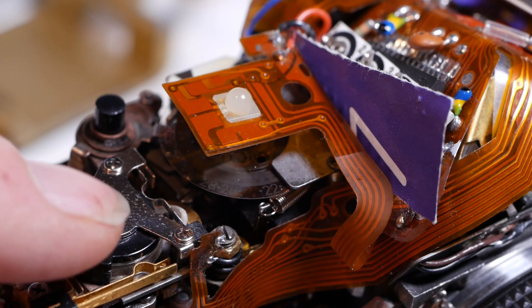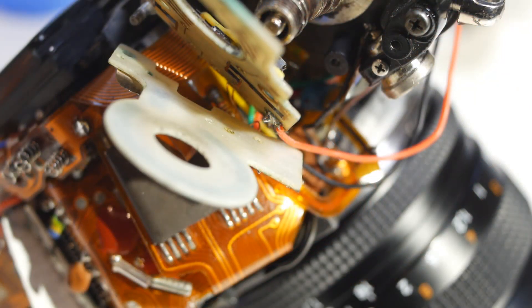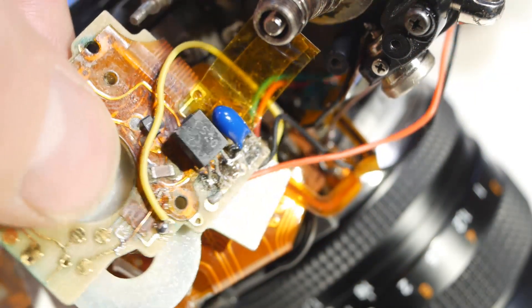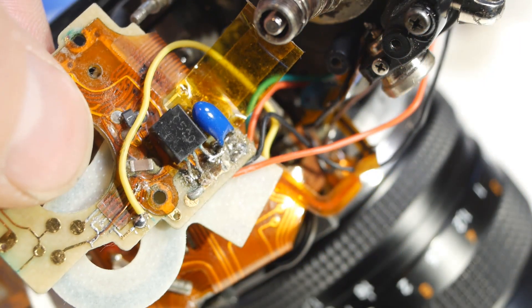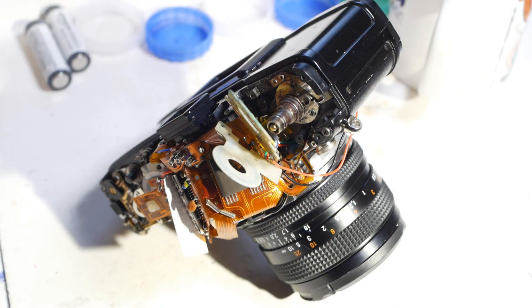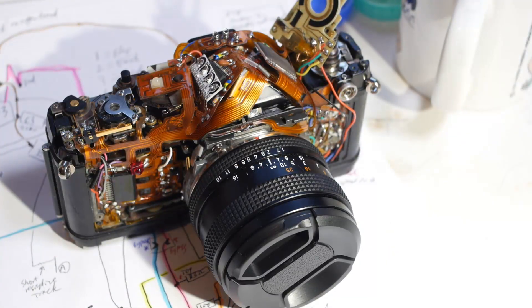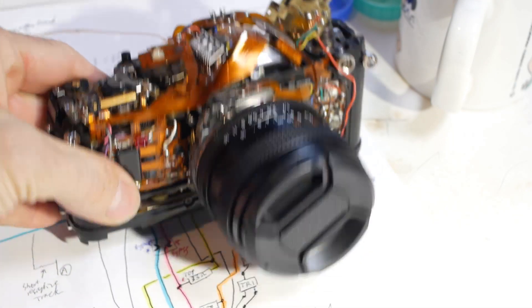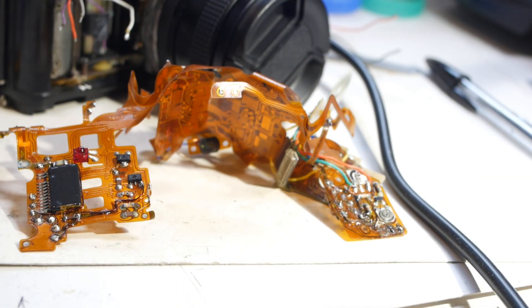Short circuit eradicated, and it's now working on battery power — by which I mean the power LED illuminates, and not much else, but at least I can now start probing the thing properly. After that I set up the oscilloscope again, the first target being the voltage regulator. And once I'd seen how bad the spikes coming out of the regulator were, I immediately powered the thing down, and am reluctant to apply power again until I can figure out what's happening. This may all be like locking the stable door after the horse has bolted, because those potentially chip-busting spikes may have already done their worst. To understand things better, I really need more of a circuit diagram, so I'm going to remove the PCB again and spend quite a bit of time tracing tracks.